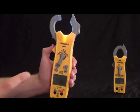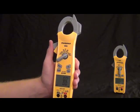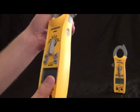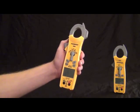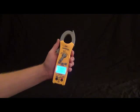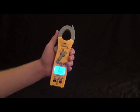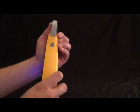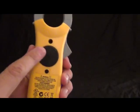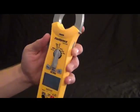Moving on to the 200 series, this is the SC260. This is our compact meter and one of my favorite ones. It has a ton of features in a nice compact package — it's going to fit in your back pocket while you're climbing up the ladder. It has the hold button on the side, the select button for ranges, min-max, backlight, and a button magnet that serves a great purpose of getting the clamp meter out of the way when you don't need it. Going around the dial: temperature, non-contact voltage, microfarads, diode, continuity and ohms all on the same selector switch, amps AC with the clamp, volts AC, and volts DC. By the way, this one's true RMS — and all the other ones I showed you were also true RMS. And that is the new Field Piece SC clamp meter line.